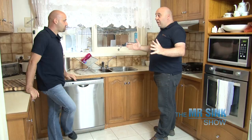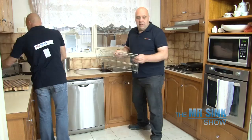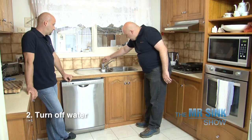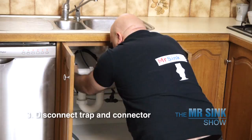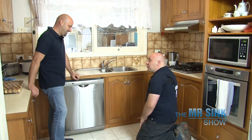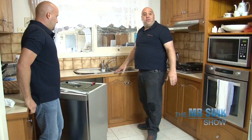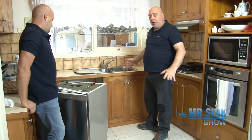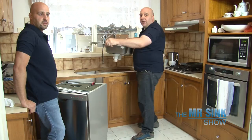All right, so we've been shopping and we've got the right sink. So where do we begin? Next thing is we need to take out the old sink. First thing we do is clear up the room and get it all clean and ready to start work. Now we're going to turn the water supply off — I can turn it off from under here. Water's off. We're going to undo the double bolt connector. Now we need to take the dishwasher out so we can get to the screws under it. We've unscrewed all the clips now, everything's been unplumbed, and the whole sink will just come out in one piece. Okay, there's the old sink gone.